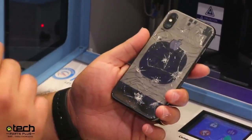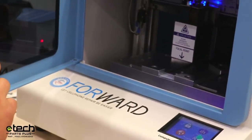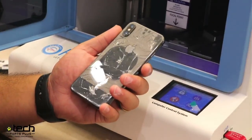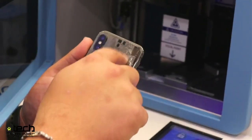Aside from down here, it didn't mark in danger areas. Up here is a wireless charging pad which is a flex cable — if the laser hits that, it can cause damage. And up here is an exposed portion of the frame where there's no metal.